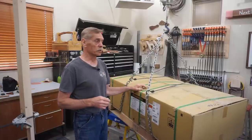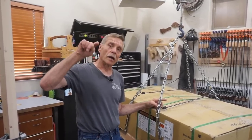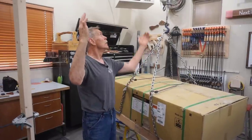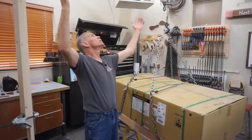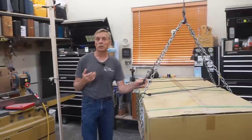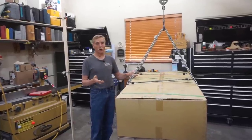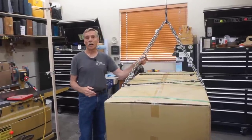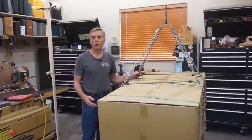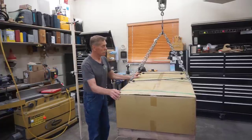The strength of the system is now focused on the eye bolt itself — that's a bent steel eye bolt, not a welded loop. By putting a welded loop up there and adding a support column, limiting the span of the double girder truss to less than 12 feet, I wouldn't be afraid to lift a ton with that. I don't want to give anyone the wrong impression — this has potential danger. If you're not paying attention, something goes wrong, or there's an inherent weakness in the design or setup of your skyhook, you could have a disaster. But on the other hand, you can clearly see here what's possible when it comes to designing, creating, and installing a skyhook for your workspace.